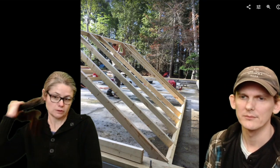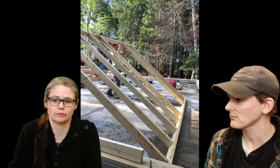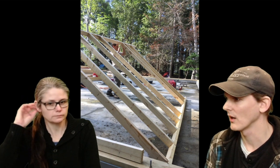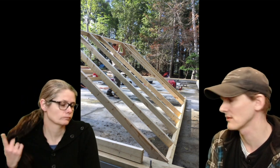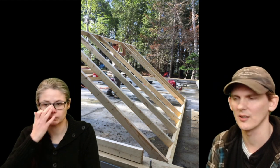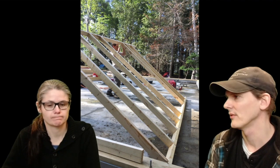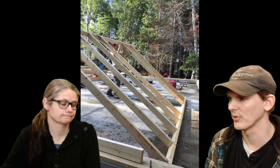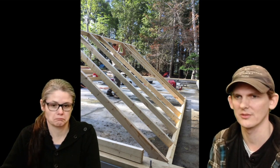And we're framing the exterior walls. How do you do that? So you take a bunch of 2x4s or 2x6s. This was a 2x4 construction. And this is a design decision: do you want to go 2x4s or 2x6s? How much insulation are you going to put in, or any at all? We didn't think we were going to heat this all the time, and didn't think it was necessary to put in 2x6 because we're not going to put in 2x6 insulation. There wasn't really a reason to.